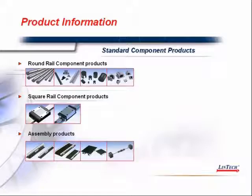The standard support housings are all steel with a simple, fixed low thrust, fixed high thrust, and a rigid style. Ball screw assemblies are cut specifically to the customer requested length. These assemblies will be more expensive versus the raw components, but it does include the cut to length screw, end annealing, and machining, and the assembly of the parts together. Common custom options include servo motor and gearhead interface for nearly every vendor.